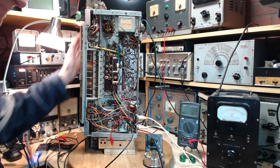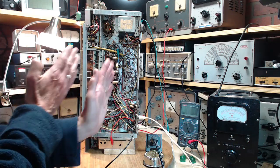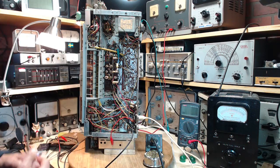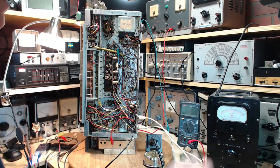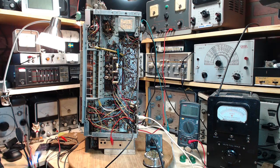Well, we heard a little bit. It's probably a fairly strong broadcast station. And that just adds to the whole theory that the front end is not aligning right. So the frequency which you want to be resonating in the front of the radio, so it comes screaming out the speaker, is not resonating in the front of the radio. Some noise area is doing the resonating, and just a little bit of that broadcast signal is leaking through. Kind of reassuring to hear a little bit out of it,